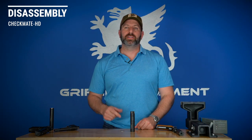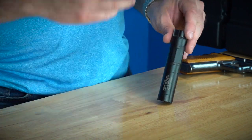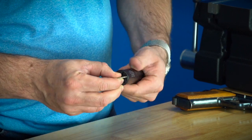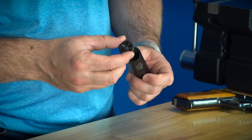For disassembly, you definitely want to check out that QR code manual — we spent a lot of time on our tech manuals and there's a ton of good information in there, as well as warnings on how not to damage your suppressor or do anything unsafe. With this particular suppressor, we're going to start with the front end cap, which is not uncommon to a lot of our suppressors. I'm going to take a quarter and interface it with the front cap and start screwing that off. It's really important to start disassembling from the front, not the back. This front end cap has an O-ring on it that interfaces with the baffle assembly.